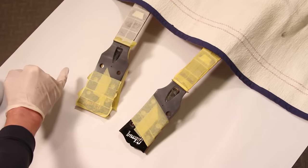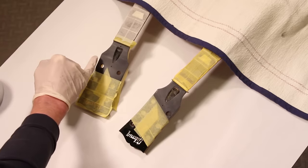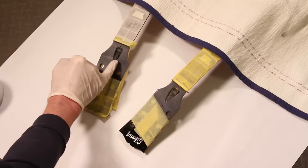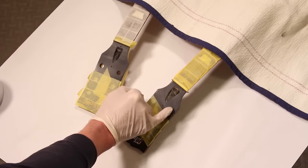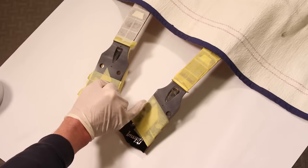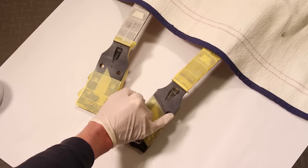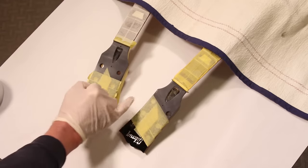So I've let the fresh paint harden overnight, and applying paint has exposed a couple of indentations in the finish, particularly just there, which became more apparent once I put some lacquer on. So I've infilled those areas with a bit of super glue, and then levelled the whole area. Why super glue?